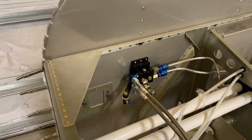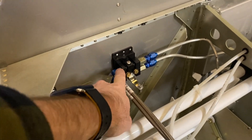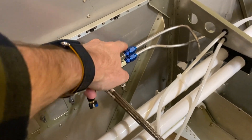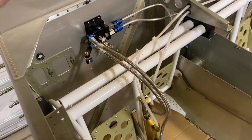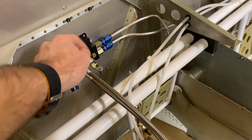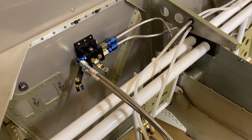The parking brake is installed and it actually wasn't that bad. You put the fittings on and apply loctite on the fitting as it goes into the block — same on this one here. I was able to use the same lines; I did have to bend one a little bit, but they go down fine — it was a piece of cake. The only thing I haven't done yet is put the cable on here. I have it, but I'll run that cable when I put it on later.